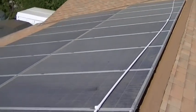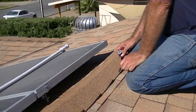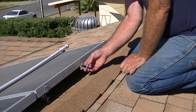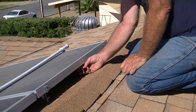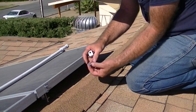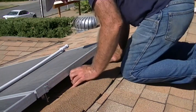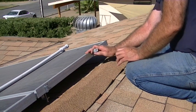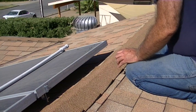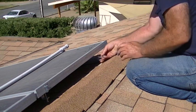I'll show you how to hook up all the hardware and get it mounted. The mounting system uses galvanized clamps from Amazon — I'll have a link — which fit underneath the lip of the panel. Then I add a one-and-a-half inch L-bracket with holes drilled out to 5/16, using a quarter-inch by three-quarter-inch bolt. Everything bolts onto the panels with no roof penetrations — you can see that across all our videos. We slip the clamp underneath the flat flange.